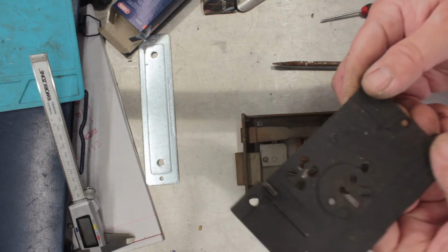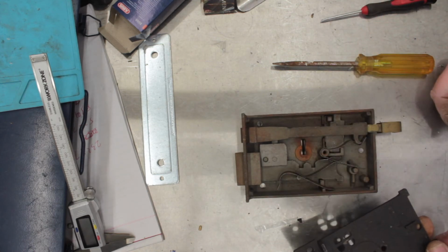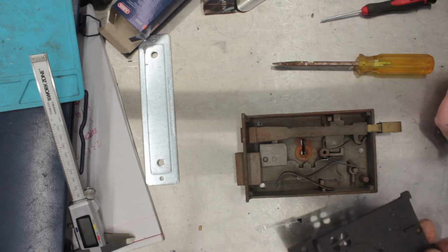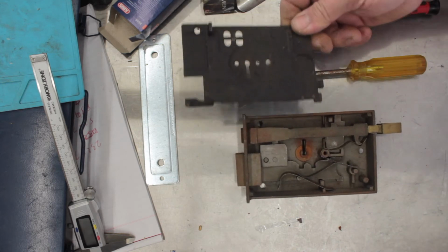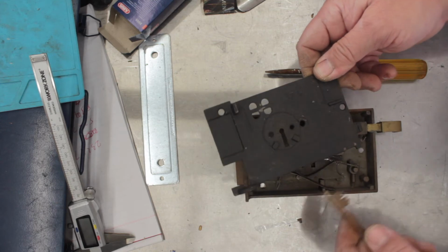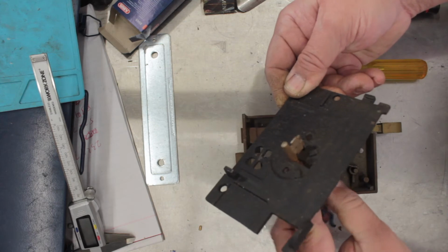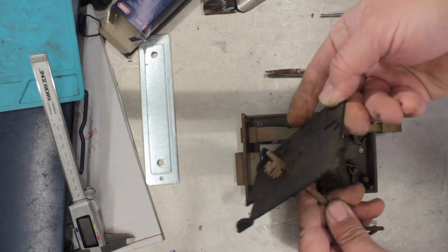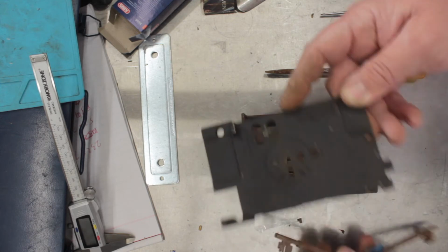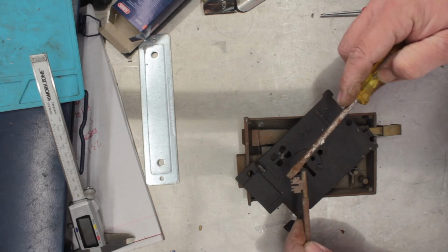Okay, so 5FL. 5FL, that's interesting. It doesn't even have one lever in here. Not one. Alright, so that's very interesting for the key actually. If you look at the key, you'd think there's a lot more security in that than there is. So these notches here are part of the security. When the key goes in, they have to be able to clear. And you can see how they marry up there. Well, you can kind of see. Basically, those notches right there is this notch right here.